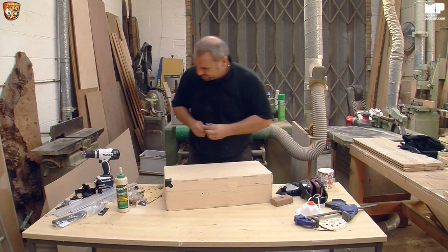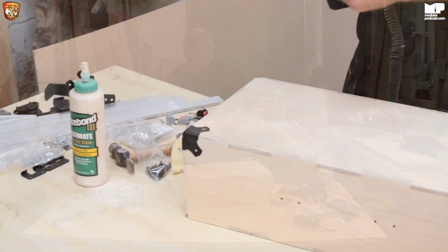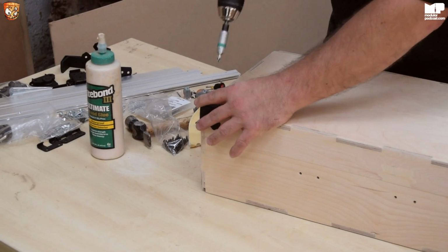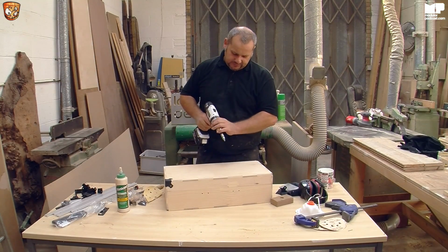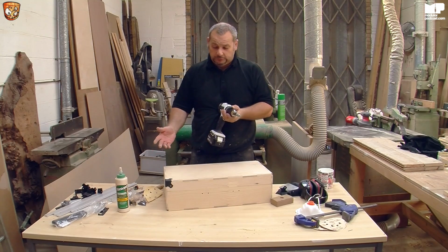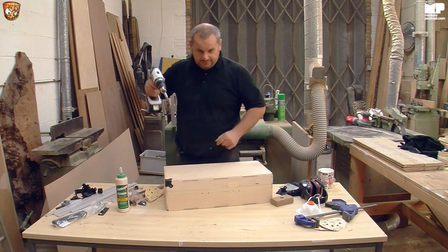There we go. Something I prepared earlier. And get your screw. Take your time, line it up properly, nice and gentle. And always remember as well, because I get caught out, I've just done it here. It's at 16. Turn it back to about 4 or 5, because all you want to do is make sure the screw goes in, because all it does is hold the corner on. It's not like keeping a door on or whatever. So there's no need to go bashing about in it.